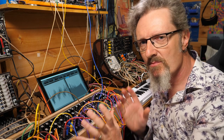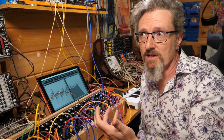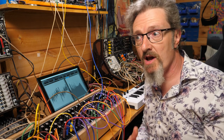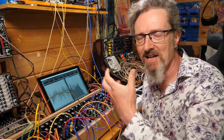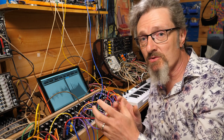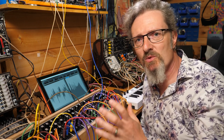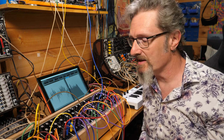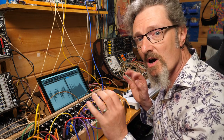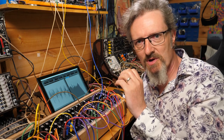It looks very Moogy. And so I imagine comparisons with the Behringer modules are going to be pretty expected and kind of obvious. The difference being is that Wavefonix are designing their modules to run in a now system, in a system that you want now. The Behringer Moog modules were all based in the past, which retained all of the weirdness of the V-trig, S-trig stuff and the kind of things that we've left behind that Moog Modular were doing back in the day. And those are the things that Behringer has very much wanted to capture. Whereas with Wavefonix, we are pushing out there with an elegant, streamlined, sensible approach to Eurorack.